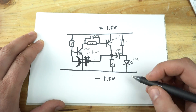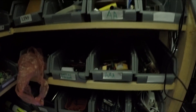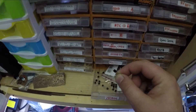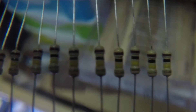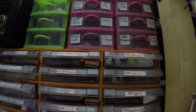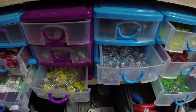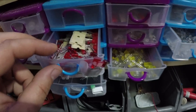These are the components you need. I have hundreds of storage boxes with a lot of electronic components. For this project, I need one small general-purpose NPN transistor like the 2N3904, and one PNP transistor, the 2N3906. Two 1kohm resistors, one 100kohm resistor, and a 47ohm resistor. Capacitors are 10nF, 10uF, and for blinking speed I'd use the biggest electrolytic capacitor, from 220 up to 1000uF. The LED can be any color you want — I'm using all types: 10mm, 5mm, and 3mm LEDs.